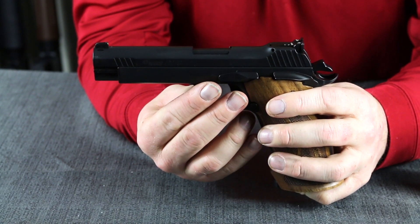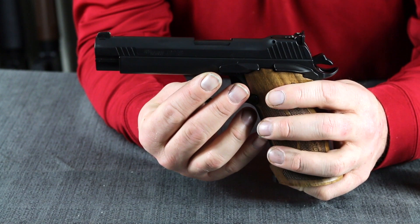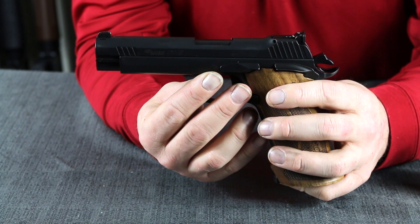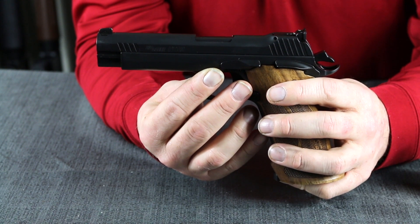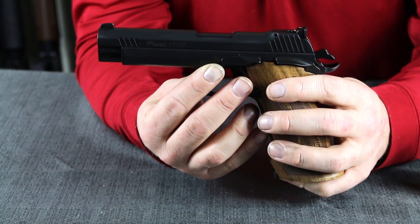Because of the way it was manufactured, it gave the P210 that incredible barrel-to-slide fit and slide-to-frame fit that was absolutely rock-solid. It was also unique because most of the time when you tighten up a slide to frame that much, you sacrifice reliability — if it's not heavily lubed you generally will have issues. Not so with this pistol. For some reason this particular design enables you to have this tight frame-to-slide fit without any reliability issues. That was one of the things very unique about it — having a match-grade pistol that was combat-reliable.